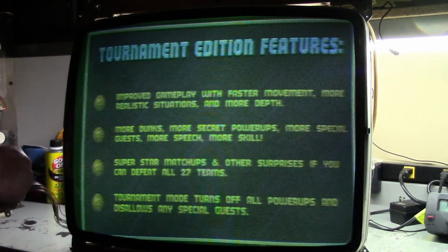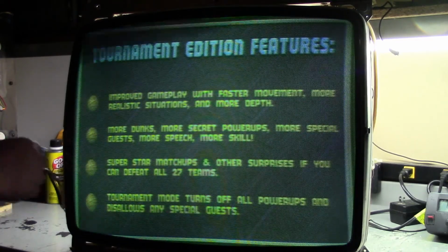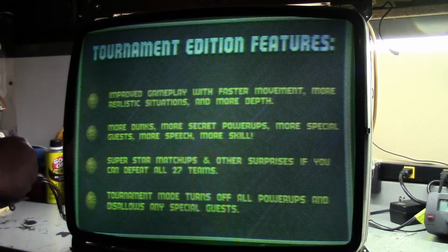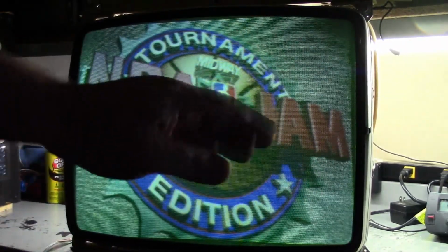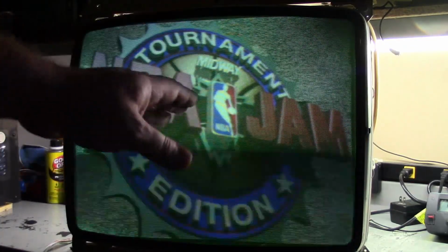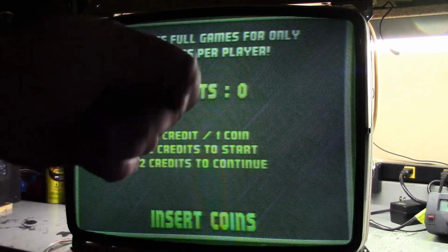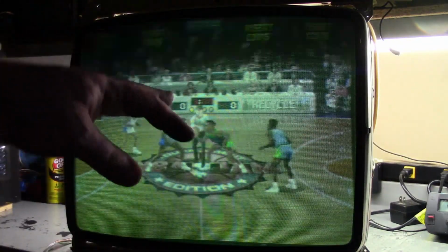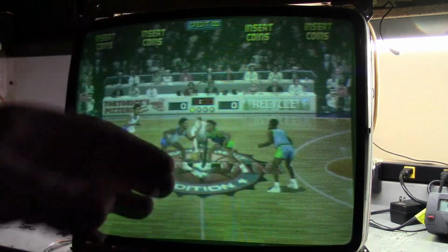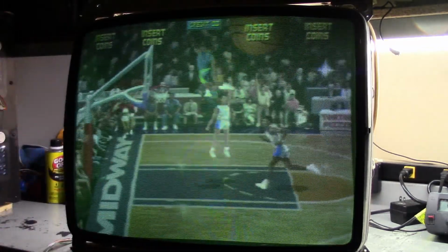H position, vertical position. So I didn't have that problem on the tube that this chassis came with, so I didn't think it was a connection problem. But that's a good example right there of why it's always important to tie those wires off on the corner of the boards to prevent them from breaking. So it must be holding on by a couple of strands. I'll have to fix that, so that'll be off camera. We don't need to worry about that. But let's see if we can make this look a bit better.